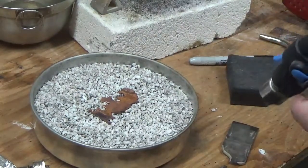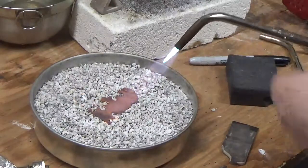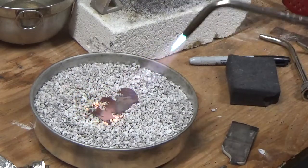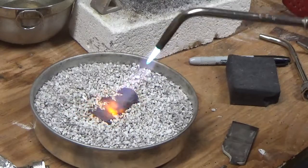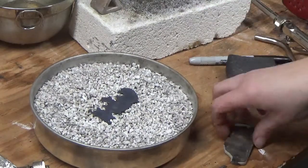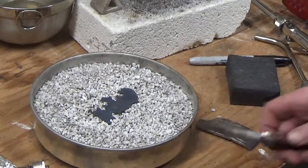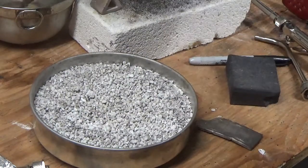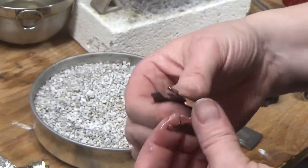This time I'm not even going to bother with the mark because I just eyeball it. I wait for it to turn kind of red — not even bright red, I just want it to glow with just a hint of pink. See how I back it off, and you'll also notice that I'm continuously moving the flame because I want the whole piece to get nice and hot. Let it sit for a second. I'm also going to show you the difference between this kind of metal and this ingot I cast out of silver that I'm going to roll out into sheet. Quench it — now it's dead soft again.